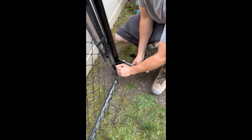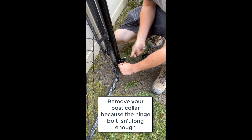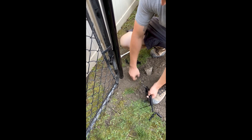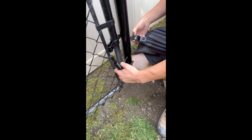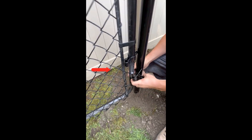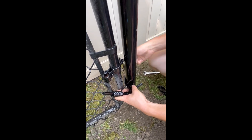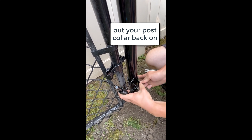The second thing you do is start removing your post collar, because the hinge bolt on the post collar you already have isn't long enough — you need a longer hinge bolt, which is part of the auto hinge assembly. Take your pre-assembled spring, make sure the top of the spring is going into the gate because that's where it gives its tension, then install the spring and the longer hinge onto the post collar you just removed.